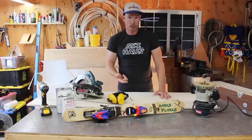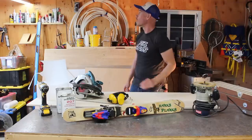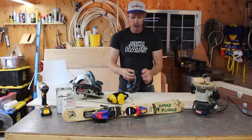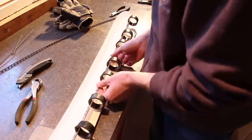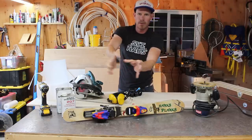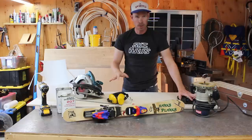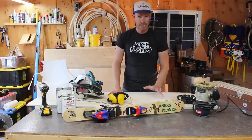If you have a vacuum pump that would be great. I did use a car in this video, which you'll see at the end. I found spring clamps to be really expensive so I made my own clamps - I took a piece of ABS pipe, you could probably do PVC as well, cut them in small sections and just sliced through so it clamps right on. CA glue or super glue works really well. Don't use hot glue. I did this with really simple tools in my garage - no CNC machine, no specialized equipment. That's the idea: I want people to be able to do this easily.